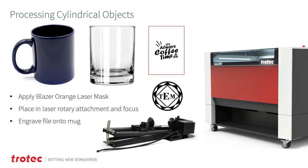Materials like glasses and mugs and cups and baseball bats are great if you're engraving into them. But if you want that depth and texture or effects into these hardened materials like ceramic, glass, stone, the lasers can produce the detail into it, but you can't get the depth. So the combination of working with the Blazer Orange Laser Mask combined with the rotary and the laser system can produce the detail, and then we'll take it to the next step with this IKONICS sand carving technology, and that will then, of course, apply the depth into it.